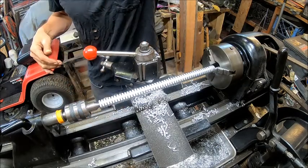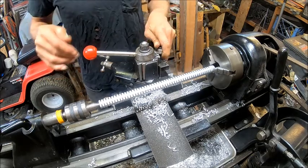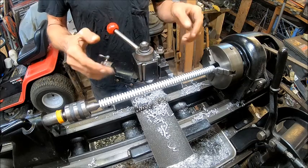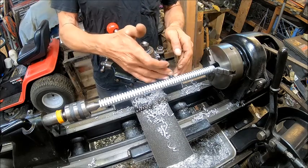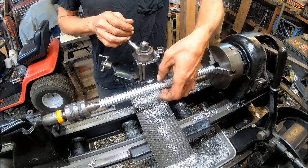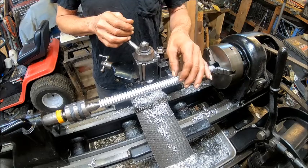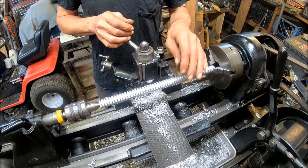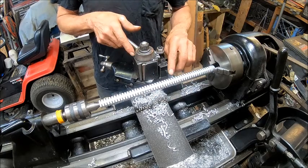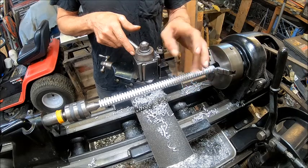So now we've got all of our grooves cut. Now we need to go in between each one of those and make those a V-groove. I usually take the V-grooved bit and go in until it bottoms out on the bottom of these grooves and no further. I just go in far enough to where it gives a groove because I don't use my cutoff to cut these off — I use the bandsaw to cut these off. I want a little groove in the center so I know I can have my blade in the center when I go to cut it.